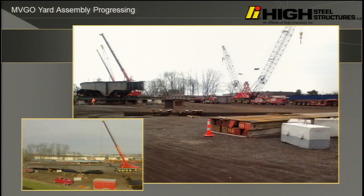So then we start building the bridge. We've got the horizontal and vertical control laid out. We start at one end of the bridge. This is a short side span, so go 130 feet away. Here's a really deep haunch girder, and then the curvature starts. And then the iron workers are telling me, Bob, we think you laid out Pier 2 in the wrong location. Because it does look like the bridge is going that way and the pier is here.